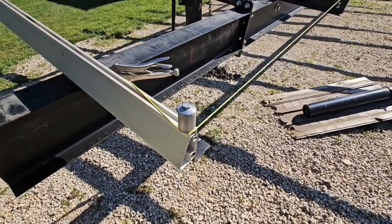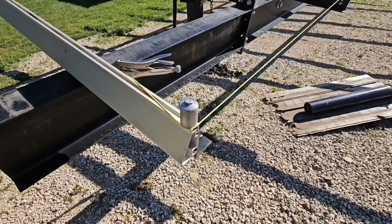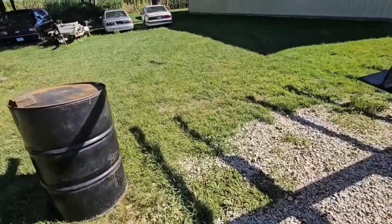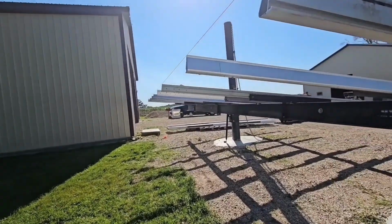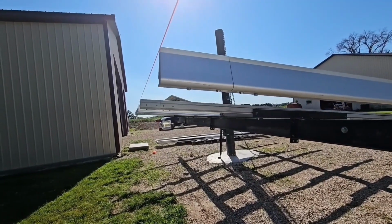Made sure I added an inch on each end, and that left me with a cutoff piece of approximately 38 inches long, because these rails are 205 inches long. So that way I didn't need extension on this end. Now the trouble you're going to run into on any of these Iron Ridge rails is they're going to come a maximum of 17 feet, which is 205 inches.